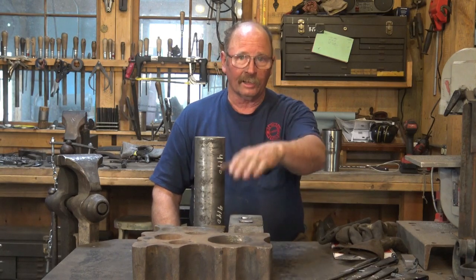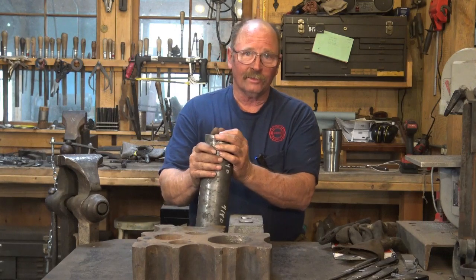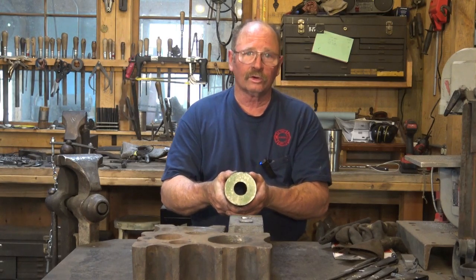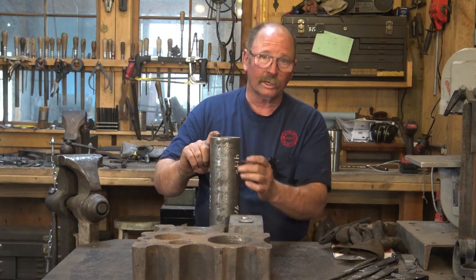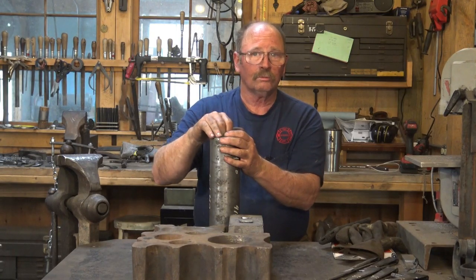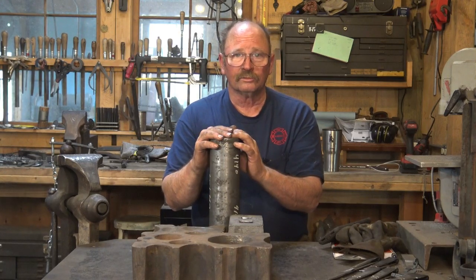I'm not sure I'm going to need another one, except maybe under the power hammer, because like I say, this won't actually fit under my power hammer. It fits under the dies fine. It just is too big for the dies, and I'd have to come up with a really weird clamping thing, and I just don't think that's the best plan. What I am going to try and do is I found this piece of monstrous tubing. It's 4140, so it's hardenable chrome moly steel that will make an excellent tool. And I think that I can cut a section of this off that's the right height. I can get three tools out of this. And I can square this up under the power hammer, and that should square up the hole, which will then need to be drifted. It's going to be a long process. This might be a whole day of squaring, drifting, and who knows how much filing and grinding afterwards to make it all work right.